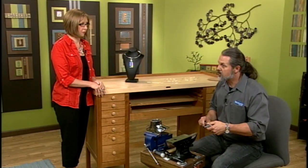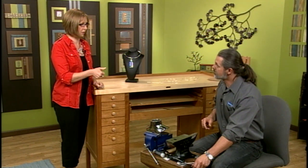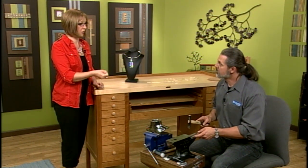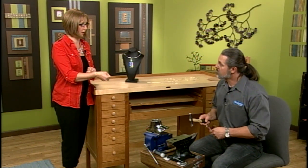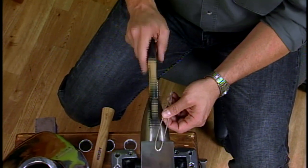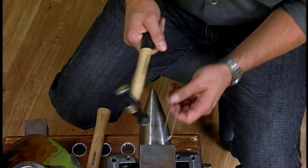It's really important to keep your thumb down and hold the hammer properly — the way you hold it when using it repeatedly can hurt your wrist if you're not careful. For lighter hammers, having your fingers involved is fine, but for heavier ones just use a good light grip, cradling it right in the crook of your hand.